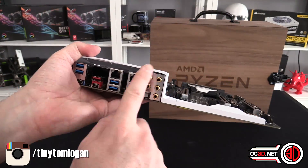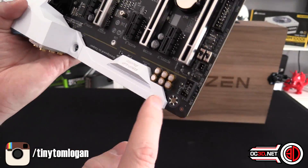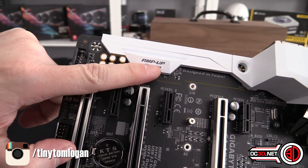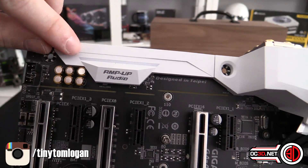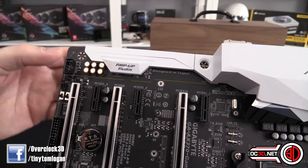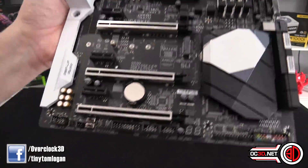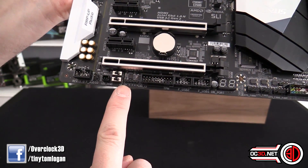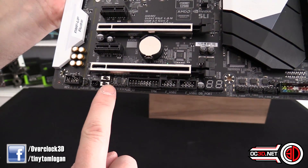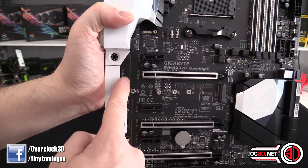While we've got the audio out here — gold-plated connectors, you can see it's all nice. Talking about the audio, we've got AmpUp audio here, and it does look like there's going to be a little light bar there which is RGBW. Then we've got the audio capacitors there. Talking about RGBW, it's down here: 12 volt out, green out, red out, blue out, and then a dedicated white out — so rather than four pins, there's five. You can also see the audio traces running down the board.